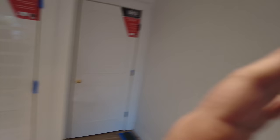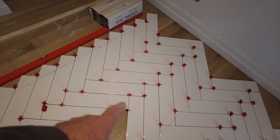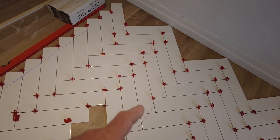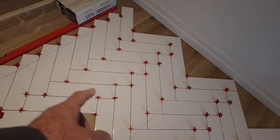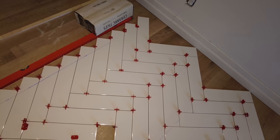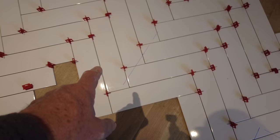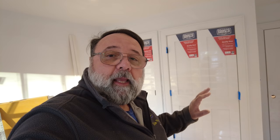Now for the other wall — this is my tub wall, and then you come around and you've got that shorter wall. You're going to measure what your drop-off is, find that spot and what that corresponds to further in the tile, and measure from where that cutoff would be. Find that corresponding line over here, then measure from that cutoff across how far your wall is going to be — and that's how you figure out what piece you're going to have on that wall. I actually did that over here — you can see that line there — then I measured off my wall and this is going to be my piece that ends up on the end of that wall.